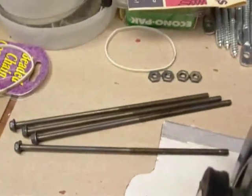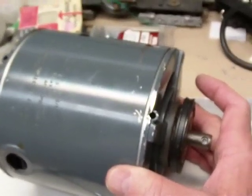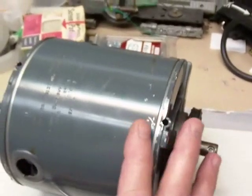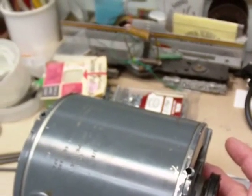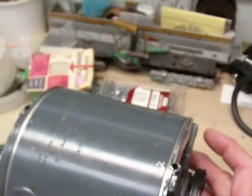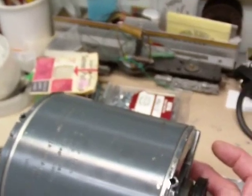I have taken the long bolts out of this motor and will disassemble it here so that maybe all of us can learn something. I've worked on industrial motors as a maintenance electrician, but I never really got involved in disassembly — the motors were always sent out for repair. The problem with this motor was the start switch, which is an internal centrifugal-driven apparatus that allows the motor to start up using additional coil power to get it up to running speed. Once the motor reaches its rated speed, the switch cuts out and the motor operates on less power.